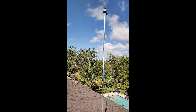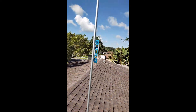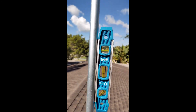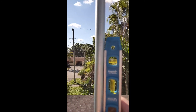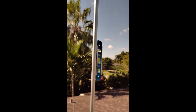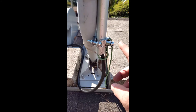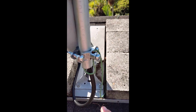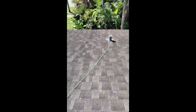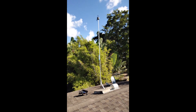There you have it — all wrapped up. We are 22 feet from the ground. We're getting a level on it — level both ways, close enough. We made all our connections, grounded here with a ground clamp to the EMT, everything nice and sturdy. The ground wire goes all the way down there to the copper pole in the ground. There you have it.